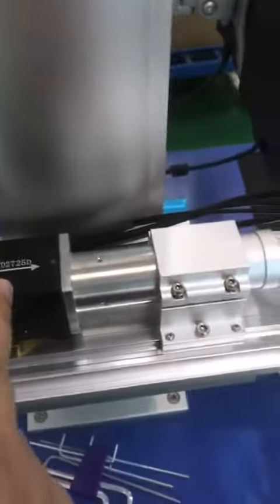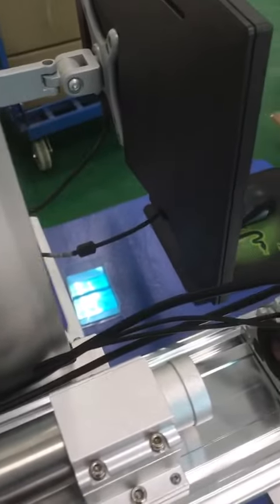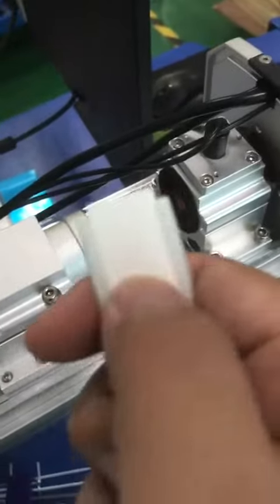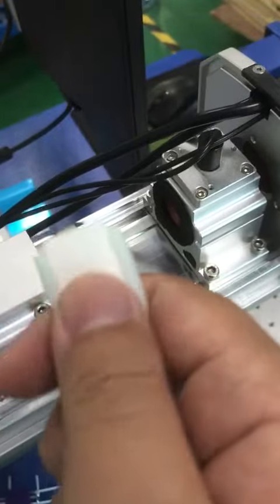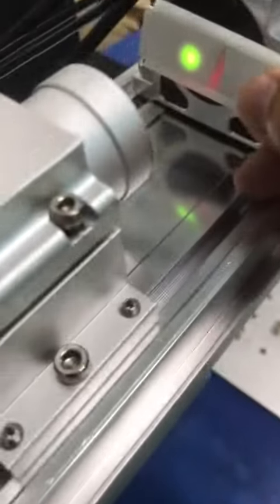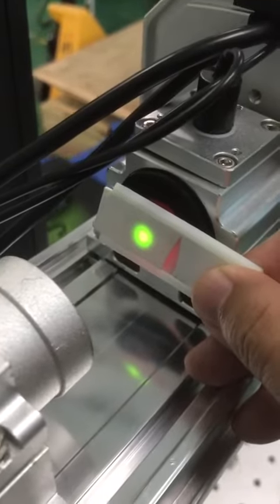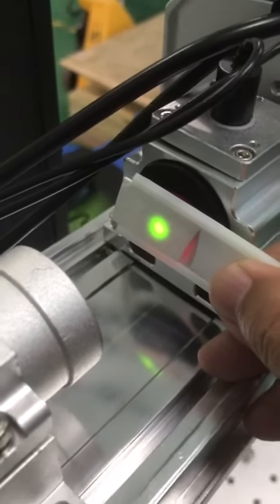You can check the beam right here. You can see the collimator, and you can place your beam checker with white painted areas in here. Directly on the white painted area, you can see a green spot from the fiber laser source — that means the laser source is working.